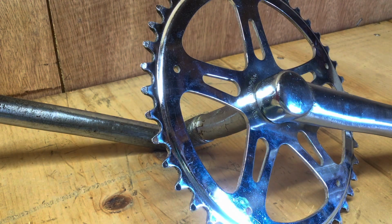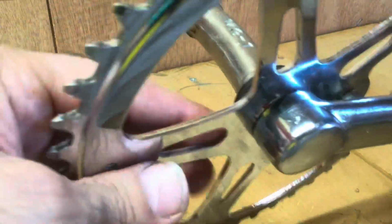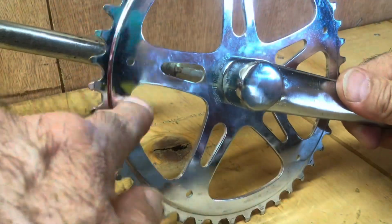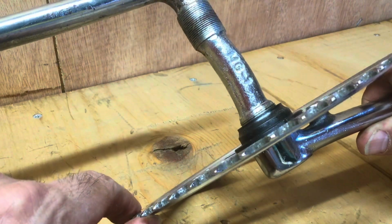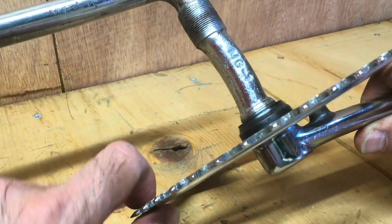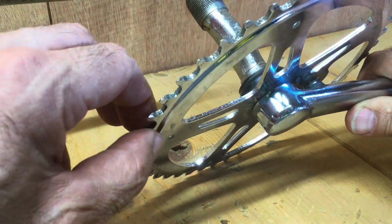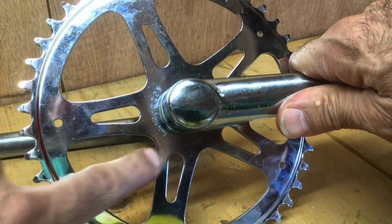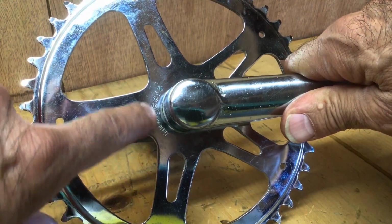So as you saw in the previous video, I have to move the sprocket outboard. Now I could turn this sprocket over, because the way it's manufactured, I can gain a 32nd right there, or maybe a full 16th. I want to do that as a last resort because I want this embossed Mongoose logo to face outward.